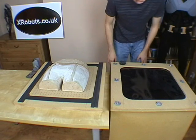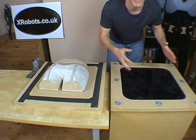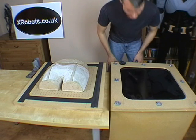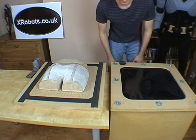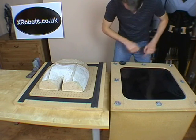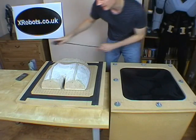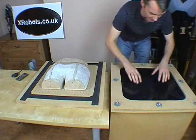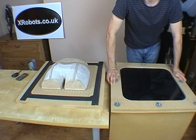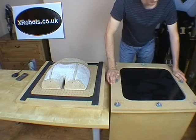So this is 1 minute 10 seconds in. You can see the plastic is starting to turn quite flexible — I can push it and it flexes. I can also smell the styrene fumes, so you'd probably best do this in a well-ventilated place. At about 2 minutes 30 the plastic is all quite uniformly heated with a sag in the middle. That's why it's quite important we don't leave this unattended, because the plastic will eventually melt and fall into the fire and everything will catch fire.